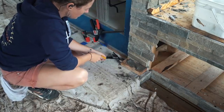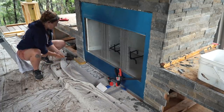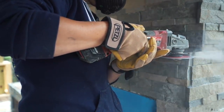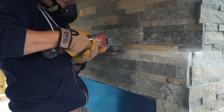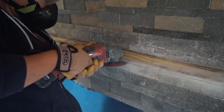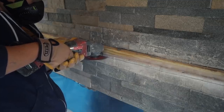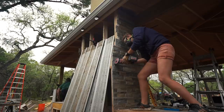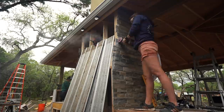Let's do some tidy work before I call this step done. After the mortar is left to sit overnight, all of the spacers and shims can now be removed. The 2x4s took a few taps with a hammer, but they slipped out easily enough. There were tons of places I left the stone just go wild, such as the top of the fireplace that will butt up to the mantle — stone fluctuates too much to make a straight edge on its own. I found it much better to leave it a little tall, pop a chalk line, then make a straight cut after it was dry. A good Diablo blade eats through the stone quickly, and a grinder is very easy to make a flat cut if you have a good visible line to follow.